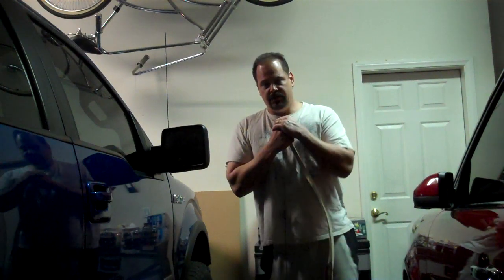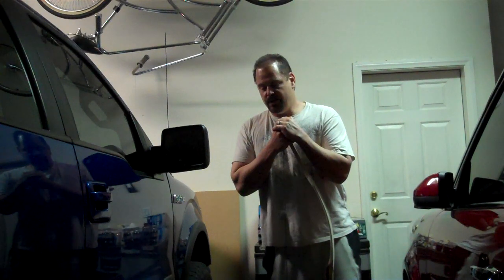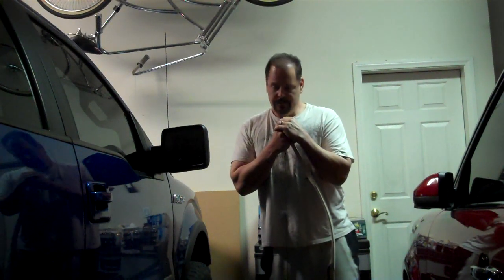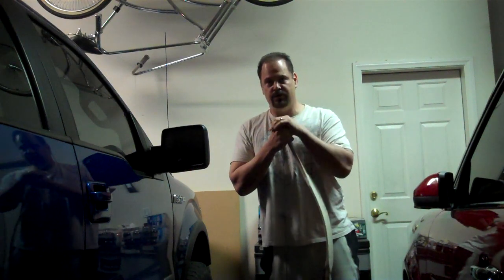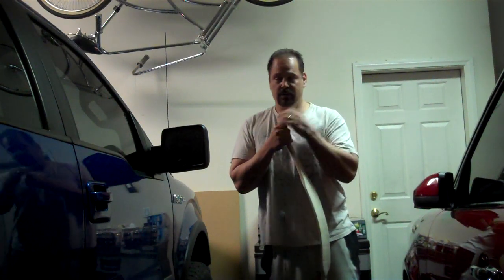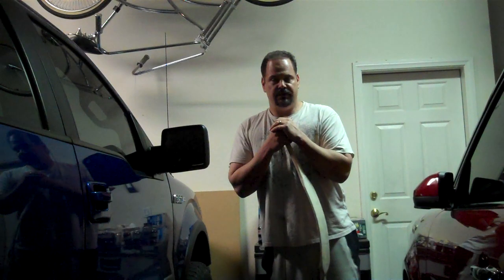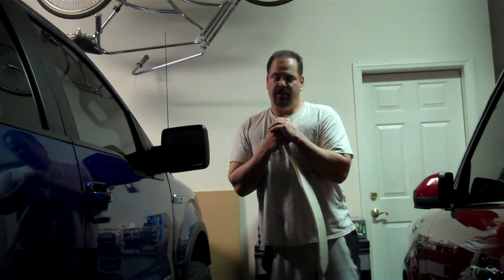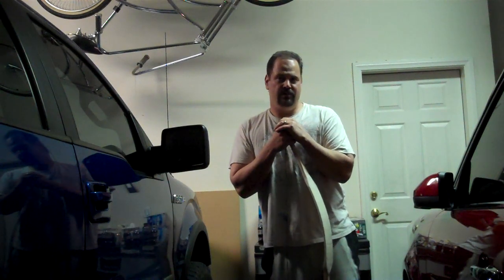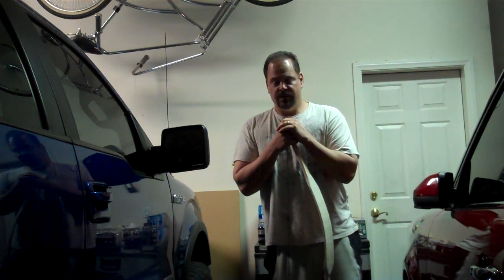Once I've got this tiller done, guys, the bow's basically done. There's just finishing involved. There's shooting in, of course. What I'll do at this point is shoot about 200 arrows through it. Really make sure it's where I want it, no vibration, good speed. If I take this amount of wood out, I'll probably lose 4 or 5 feet per second. So I'm figuring the speed, at least with my arrows, is going to stay at about 160 feet per second. It was about 63 pounds at 28 inches, so it'll probably go down to somewhere closer to 60. That's my guess. And we'll see what happens when it's all done.